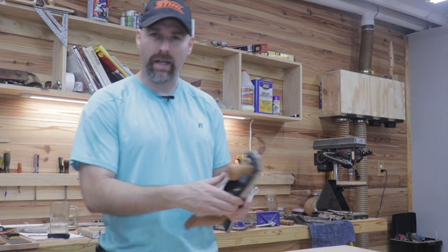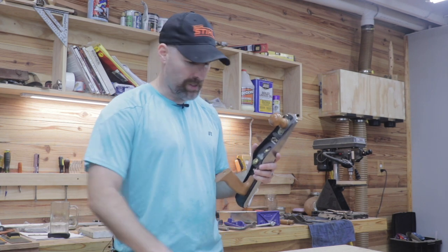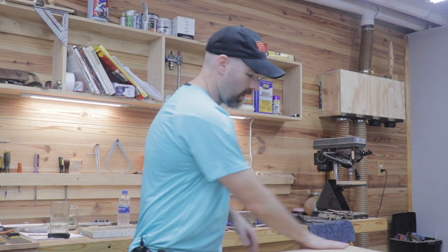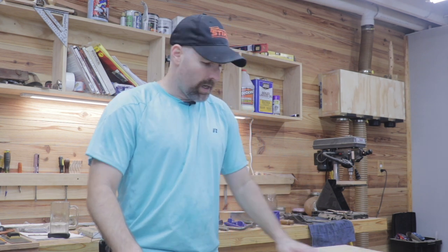While I catch my breath — that's a lot of work to flatten the back edge of that board, and it is, especially with a board this size. Now depending on the project you're building you may choose not to flatten the back side. In a lot of historic furniture, the back wall of a cabinet oftentimes was not actually flat — it had a little bit of a camber because they only dimensioned the edges and flattened the front side that shows from inside the cabinet, but the back side would actually be rough. For my project on the treadle lathe this will actually be more for looks than anything — I really only need one surface that is perfectly flat.